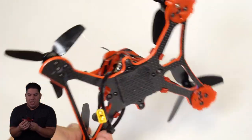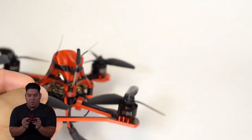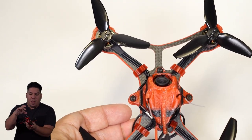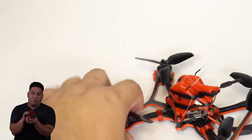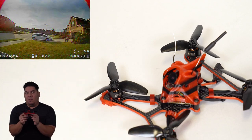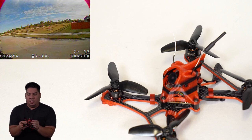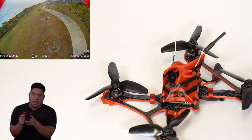I'm just using these, and it looks so fantastic. I'm not sure why no one else has really thought to include this with a frame. Really, really great option. And as you can see, the pod actually attaches to standoffs that run outside of the whoop board. You see how that works right there, guys? That really gives you some peace of mind, because your pod is not on the same hardware that your board is. That'll help isolate and keep that safe in there.